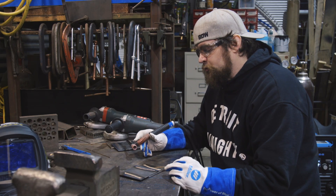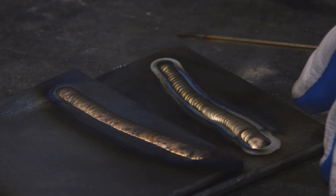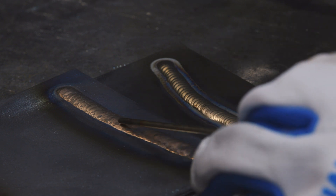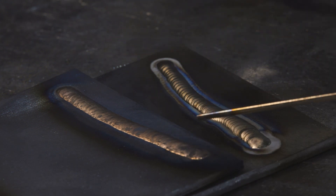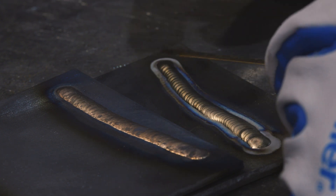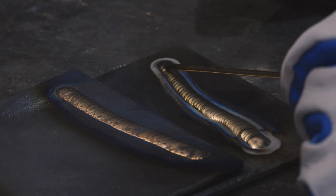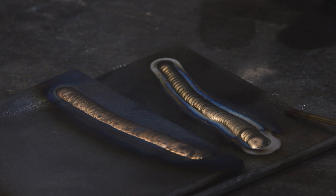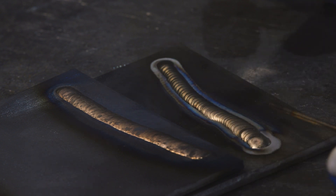So you can see right here the difference between welding with DC and welding with AC. Even with the AC balance turned way up, it's got this nice clean bead — neither of these have been brushed at all. The AC cleans really well. The DC flows a little better and you're able to keep your edges really nicely, but you'll get this layer of junk on top. With the AC you're already cleaning that away. It's just like the outside of an aluminum weld where it's breaking the oxides and pushing them out of the way. This has a much wider heat affected zone, and this is a narrower HAZ — you're seeing where the cleaning action took place and pushed everything out of the way, giving you this nice clean surface.